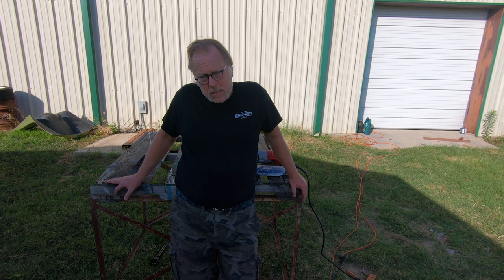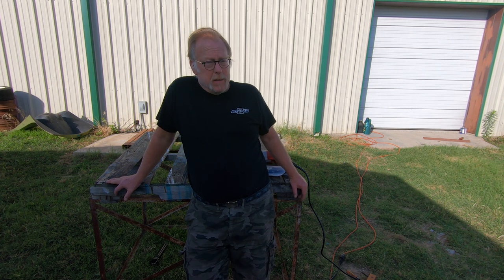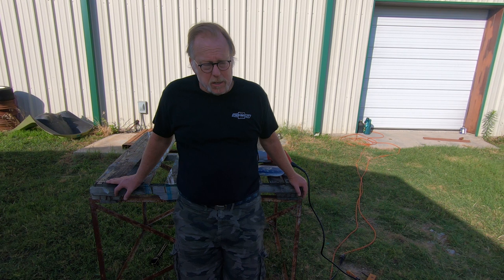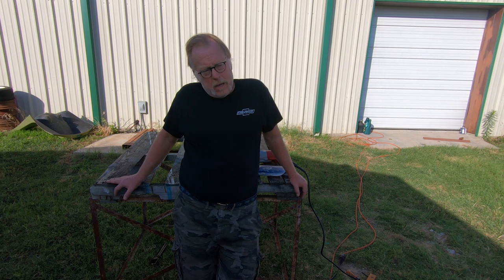The avionics stack and all that, we're going to harvest all of the old radio wiring out of the aircraft. There is actually a lot in the belly going to the back of the aircraft from the old 1960s radios, just a lot of weight. That'll all get ripped out and terminated. We're going to get rid of the old antenna wiring. There's a lot of opportunity for corrosion and breakdown of the insulation on the old antenna wiring that's been in there for going on 60 years. So all of that is going to go fresh so that we have good antenna wiring.